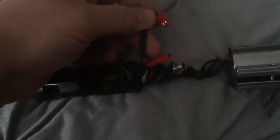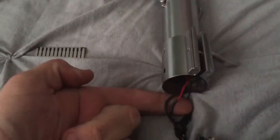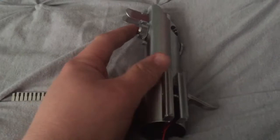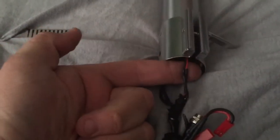This is a quick disconnect for the battery that I kept wired in. That way, for shipping or shelf time or anything like that, it kind of serves the same purpose as the kill key for the recharge port here. Now, it looks like there are a lot of loose wires in here — let me explain that. We have the two wires on the left that are heat-shrinked here; these are going to your switch right here. I left those longer that way you can easily change those. So those run up along and into this switch, which is just going to be your regular push-button switch.